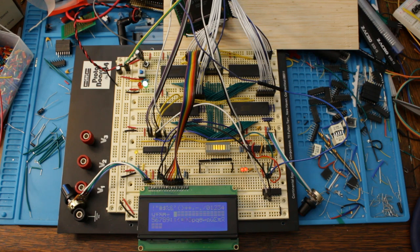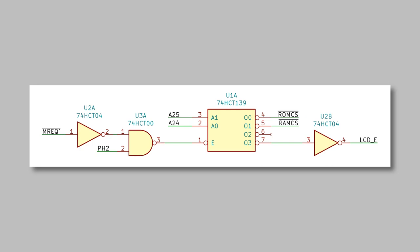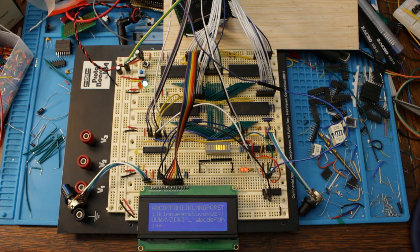Pleased with that - it works really well. The way I've hooked this up isn't great though: I'm using a NAND gate for address decoding using only the top bit of the address, which means there's no space in the address space for any other devices. I'll probably swap that out for a 74HC139 decoder, which will give me four different devices: one for ROM, one for RAM, one for the LCD, and one left over. I can use the other half of the 139 to support byte-write to RAM, which I'll need eventually. I did quite a lot of prep with the previous few videos, making sure I understood how the buses worked, and that prep really pays off.